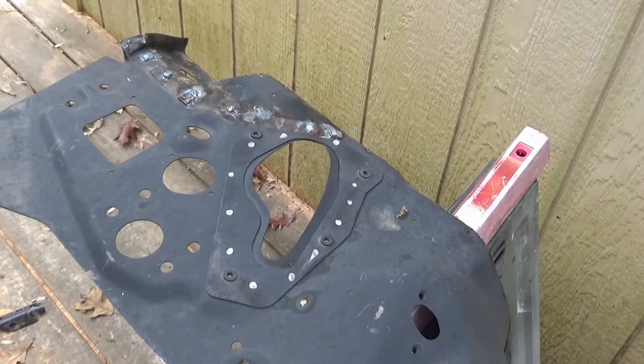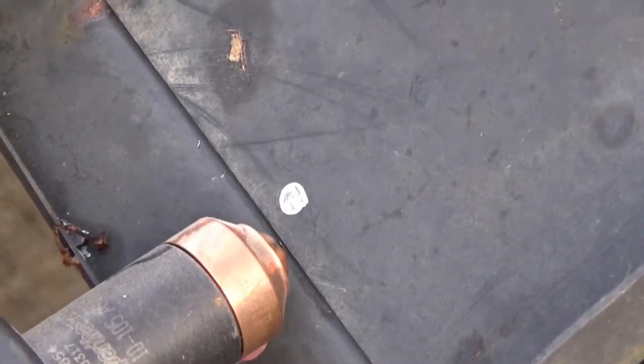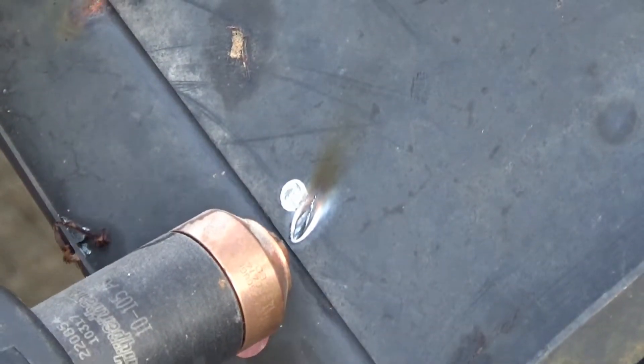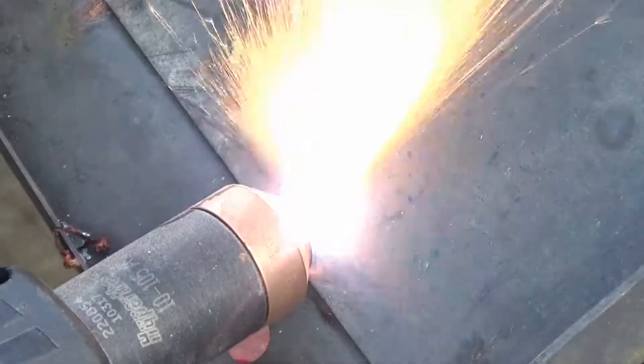Map and mark all the spots with a marker that will contrast against the metal. Place the end of the torch just beyond the edge of the spot weld. Push the trigger and start the arc, warming up the metal until it glows. This happens fast.